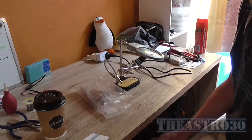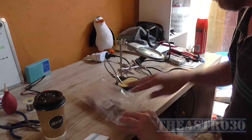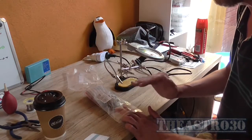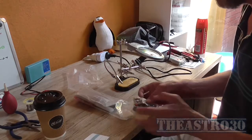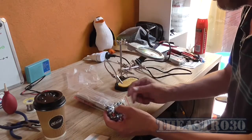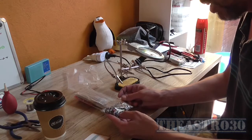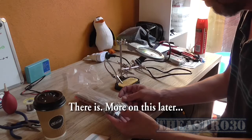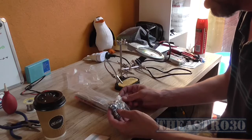There's not much really to say about this particular kit of assembly instructions. I'm going to leave the display module to the last part. There is a BNC connector socket in here which has to pass through the plastic front panel into the circuit board before it's soldered, so you put that on definitely last. And I don't think there's anything really special about these switches. I will check into it. The only difference is one's got a red thing on it and the others will have grey on it, but I'm pretty sure it's the same switch.